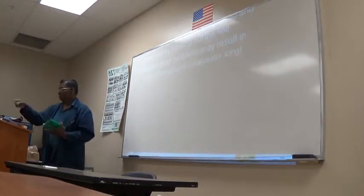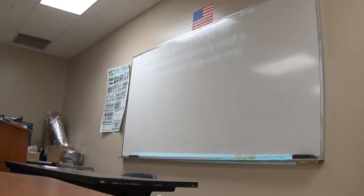Guys, whenever you use an electric expansion valve, this is the controller board you have to use. What I have here is a room temperature sensor, defrost temperature sensor, suction temperature sensor, and what we call a suction transducer, a pressure transducer, which is on the suction line at the bottom. So all of these have to be plugged into this board.